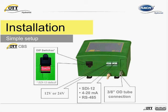the minimum measurement interval would then be dictated by how long it takes each sensor to complete a measurement. For example, if the sonde requires one minute to complete a measurement and the precipitation gauge has an instantaneous measurement available and the compact bubble sensor requires 53 seconds, the minimum measuring interval would be two minutes. Also take note of the sensor's address if using SDI-12. The sensor address and the data logger's address using SDI-12 need to match.